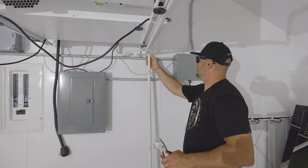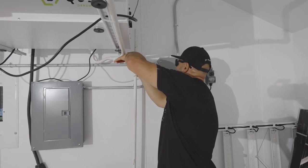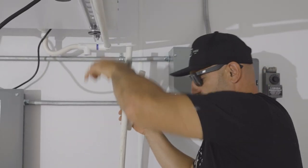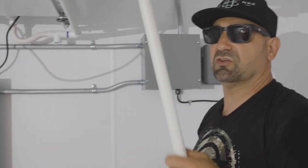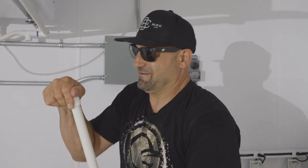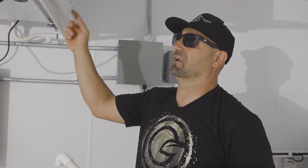It's really important when you have a brand new dehumidifier or air conditioner to let plenty of water flow through the unit, because in new manufacturing they use a lot of oil, a lot of solder, and a lot of contaminants. This water coming out of these units is going to be very dirty for the first hundred gallons. So I'll have those units on and I'm not going to reclaim any of that water — I want to get rid of all the oils and contaminants before I put it through the Hydrologic ARX system.